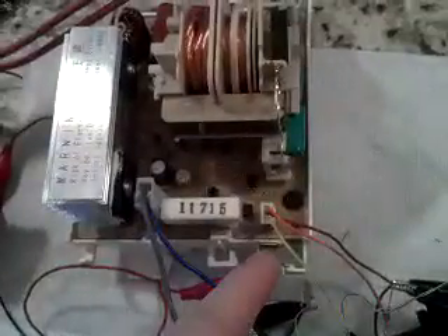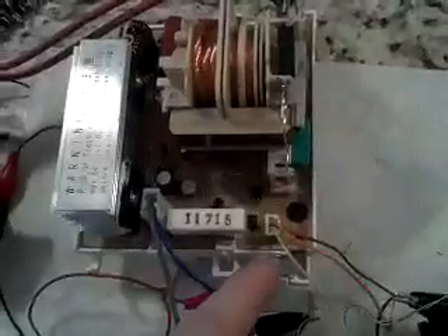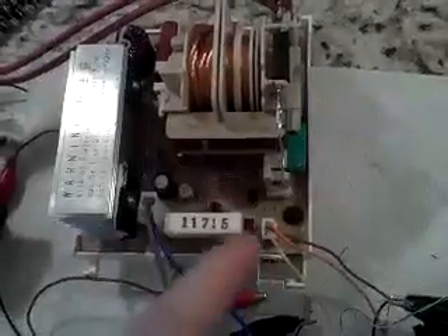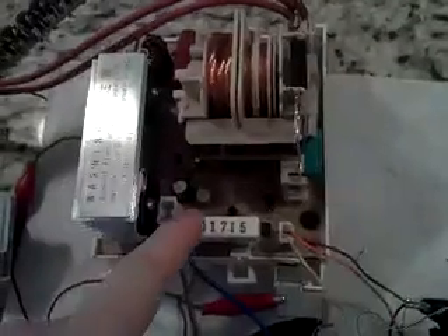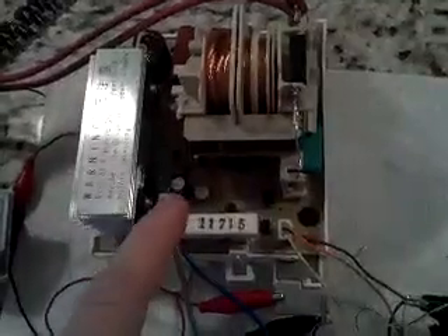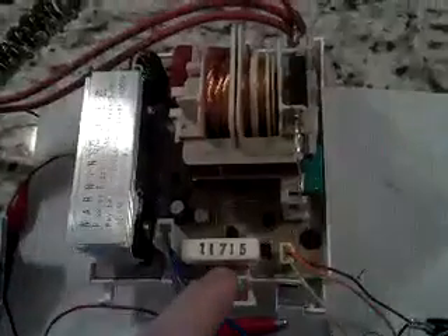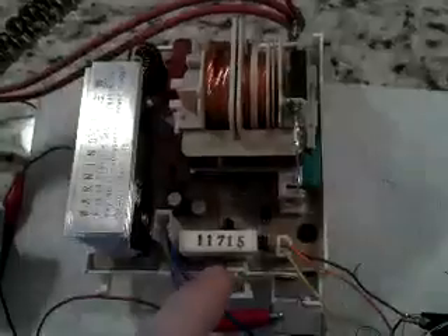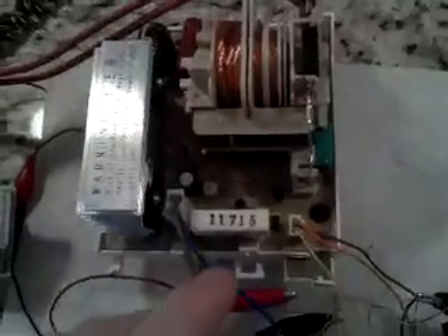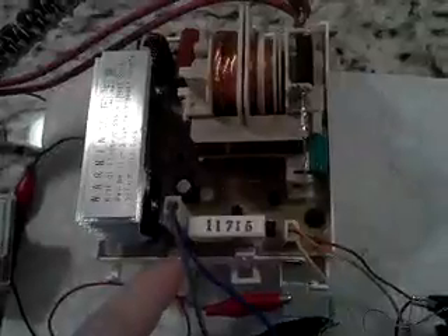The yellow line is where the magic happens. That is the pulse width modulation control input. You need to provide a 220 hertz square wave with a variable duty cycle. The duty cycle determines the percentage of output power that the inverter produces. It has some type of sensing circuitry in it which will only allow it to produce output when it receives a square wave that's within the right frequency and duty cycle range. In order for the inverter to start, you must apply a square wave with a duty cycle that is less than 43%. You can ramp it up from there, but you have to start at 43% or below. If you start out higher, the inverter will lock out and you have to remove line power and reboot the thing, essentially, before it will produce any output at all.